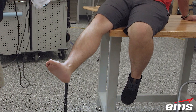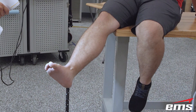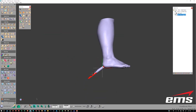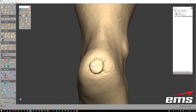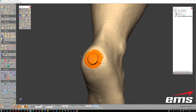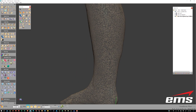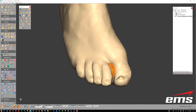With this fixture, we can get all the way around the leg and the foot without them moving, with only a small area without scan data down by the heel. Once we have the limb — in this case a leg — 3D scanned, the next step is to clean up that scan data. We have to remove the post where we held the foot up and then clean up all of the 3D scan data. There are many different mesh editing tools you can use. Scanners like the Peel 3 have some nice software tools to go in, delete, clean up, do basic smoothing, hole filling, and prepare the model.